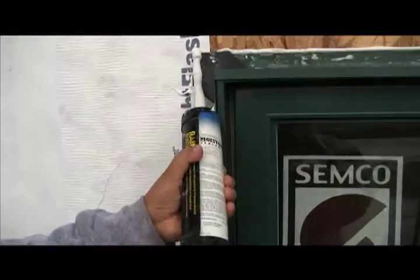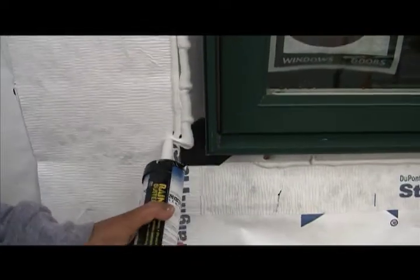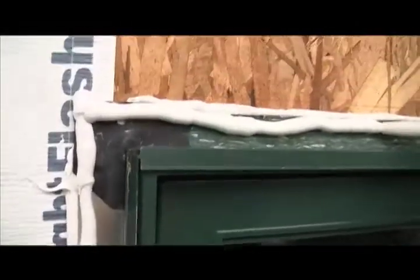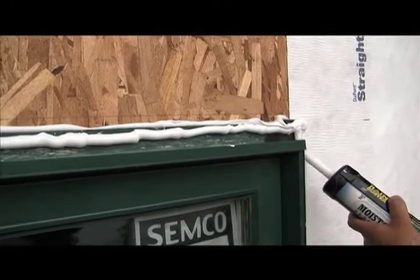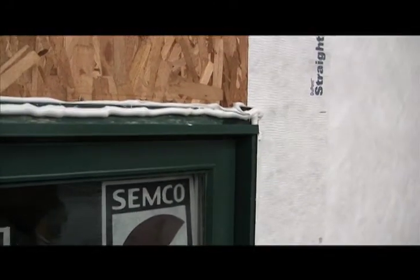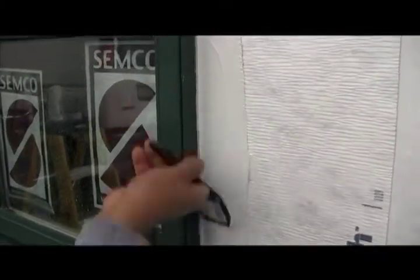This is considered an enhancement to the B1 method: instead of applying a peel-and-stick membrane on top of the nail fin, we're going to use sealant. We apply sealant straight across the line that the fasteners create, then butter it flat. This provides terrific protection against subsequent trade damage. The putty knife is radiused on the corners so we can get a really nice application of sealant at that pivot joint. When you butter the sealant the way Percy is doing it here, the sealant kicks into the pivot joint and this cannot leak.